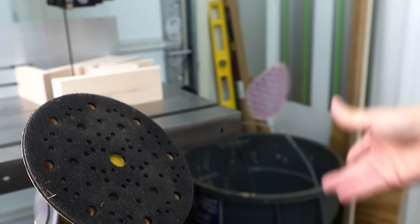As a general rule of thumb, after about 25 minutes or so of sanding, even the best performing disc has reduced its effectiveness by around 50%. So once you get halfway through a podcast, change out your disc, because you're going to spend more time sanding than necessary.